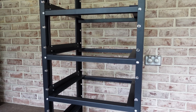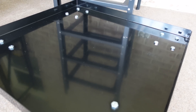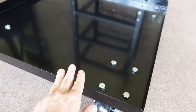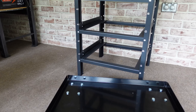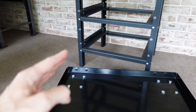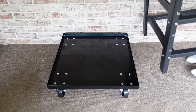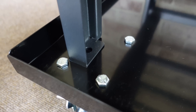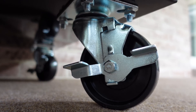I'm still not sure where exactly I want to position this rack because I haven't gotten my inverters yet. So I picked up this dolly cart on Uline — it's rated for 1,000 pounds, and this rack should only be about 450 to 500 loaded, so we're at about half of its rated capacity. But the steel just feels kind of flimsy. I'm going to use it anyway because I noticed that the feet of this rack line up with where these wheels are, so the weight from the rack will be transferred directly down to the wheels, which are reinforced with some pretty thick steel. All four of these wheels lock, so I'm not having to worry about this cart wheeling away.